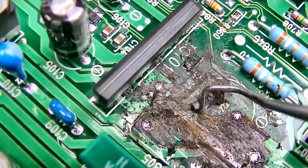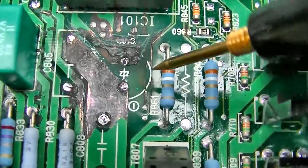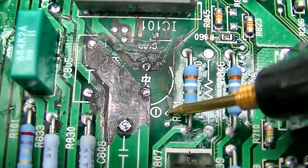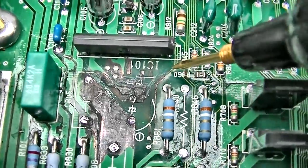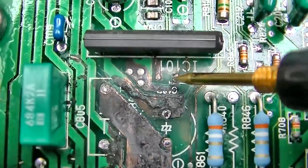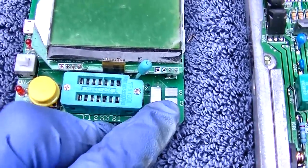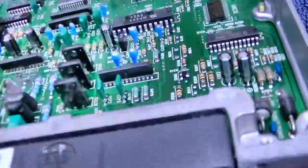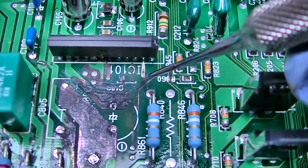I take that back — this thing was eaten up and this side was totally gone. It looks like it was a capacitor. There are two traces here; the one on the inside is missing, so we have to replace from here. I traced it down and it comes over to here. The Cap Wizard is good for tracing these wires until they go away. The capacitor here is a bit of a mystery — I don't know where it went. I was trying to measure that little chip capacitor and it slipped, flew into the air, and it's gone forever.